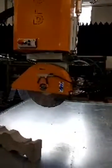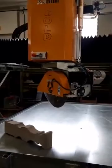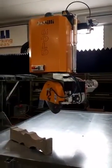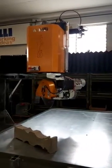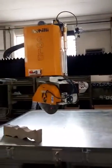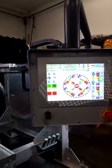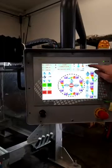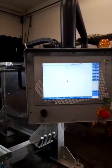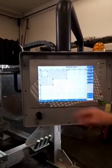Talking about machine operation, in the Gold, 3 axes interpolate simultaneously — equal to the MBS, but obviously in the more complete version, having the automatic rotation of the head. The touchscreen panel has a simple user-friendly interface with special macros permitting the drawing of particular point-to-point figures by entering Cartesian or polar coordinates. It is possible to preload parametric figures such as hexagon, octagon, trapezium, and polygon, as well as L-shaped kitchen tops and inclined surfaces.